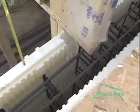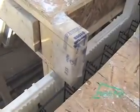Now we're going to cut our next piece that's going to come up and over the beam here and set it over top, and that's it. The beam's boxed in and the poly's on the end of the beam, so everything's protected and we're ready to rock and roll.